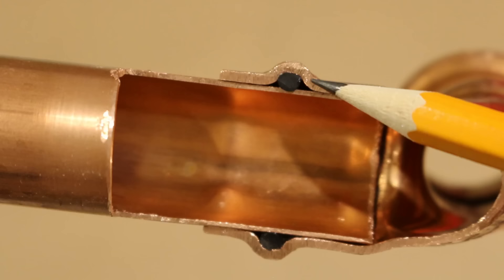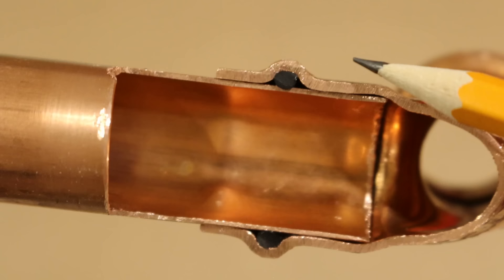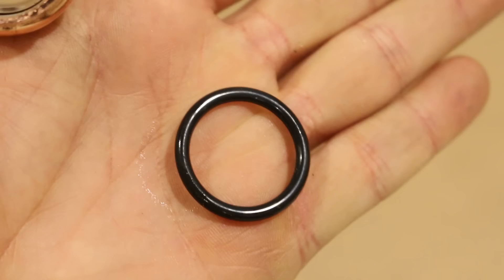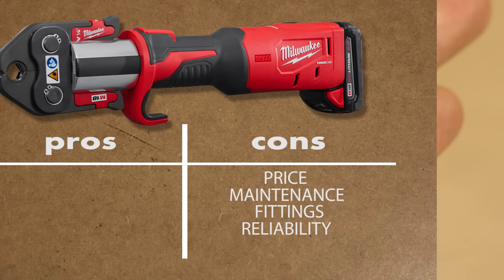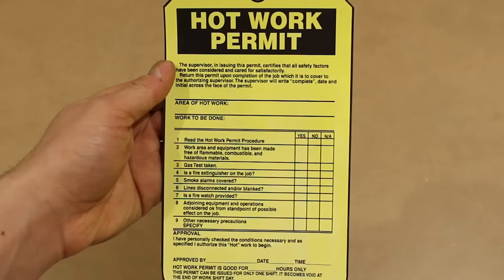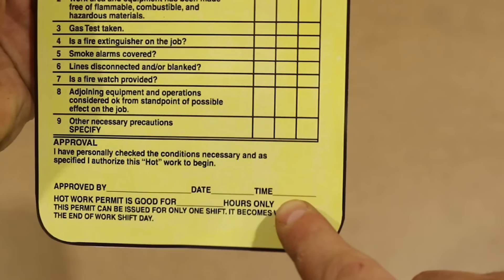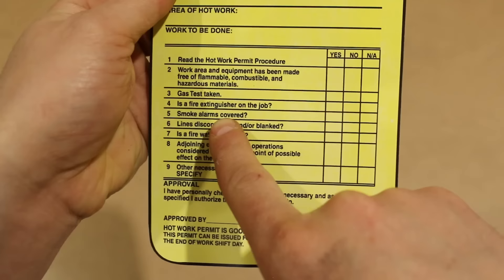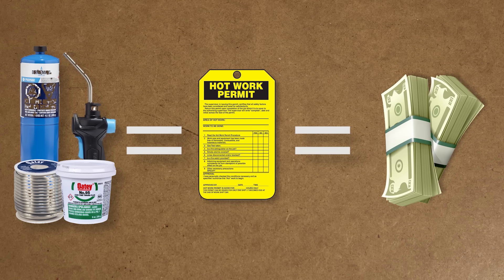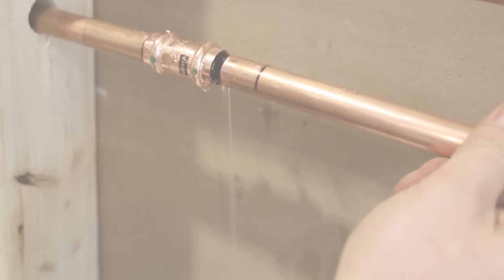And lastly, the fact that the fittings rely on a rubber O-ring could cause concern, as rubber does deteriorate over time. However, the O-rings are pre-lubricated as they're manufactured, which addresses the drying-out problem. Now onto the pros and why this tool is such a game changer in the plumbing industry. Anytime working in a commercial building, a hot work permit is required. This permit allows you to use a soldering torch at a predetermined time during the day to make sure all the smoke alarms in the work zone are covered and not activating the sprinkler system. You also typically need to wait one hour after your last solder to make sure nothing catches fire. These procedures are costly and time-consuming compared to a press tool, which requires no flames — thus, no hot work permit.